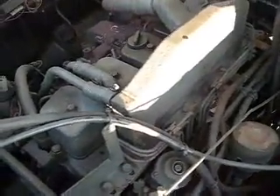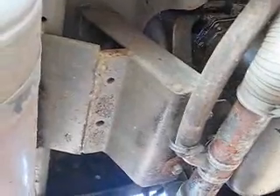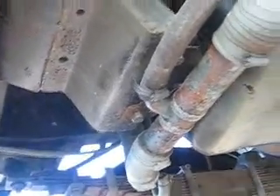The twist is probably less than 2 degrees, and we contacted Cummins, who said that wasn't a problem. We used the original rear engine mounting blocks — there you can see one — and we fabricated a new front engine block mount. Here you can see the fabricated single front engine mount that we did to connect to the engine.